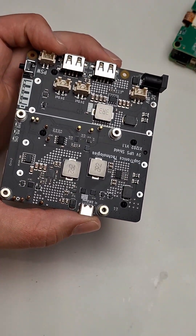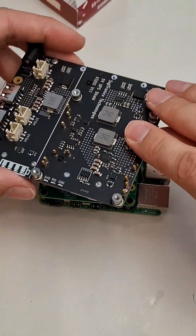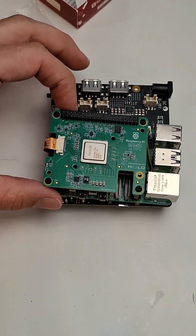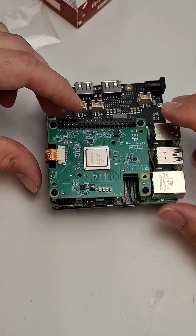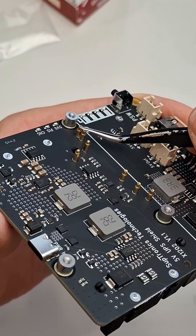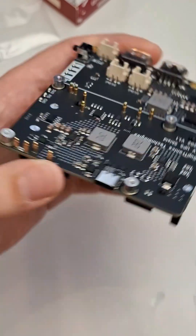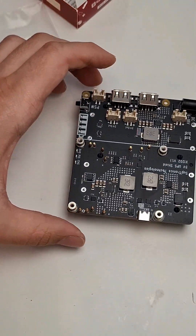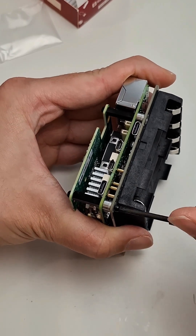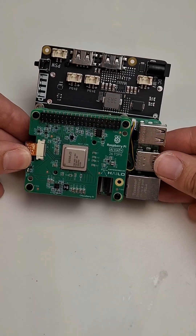While this isn't explicitly a solar powered battery charger, it does have a DC input jack that we can connect a solar panel to via a DC regulator. And while that's not ideal, it is good enough for now. This is designed so the Raspberry Pi sits on top of it, which is what we want because the AI hat is actually blocking the header pins. Instead, it uses pogo pins to connect power and comms via pads on the bottom of the Raspberry Pi. Unfortunately, the screws that came with the AI hat weren't long enough to also attach the UPS, so you'll just have to imagine what that looks like all connected for now.